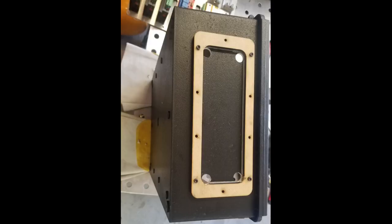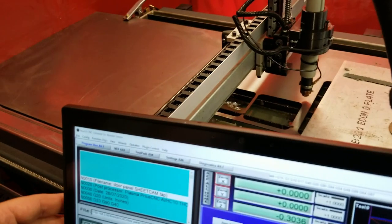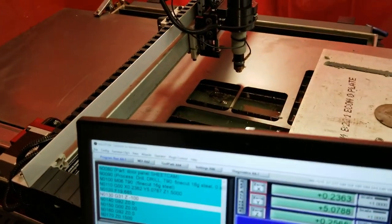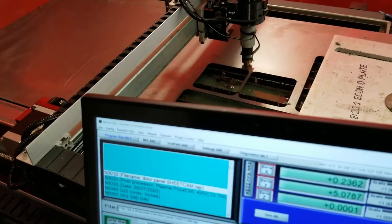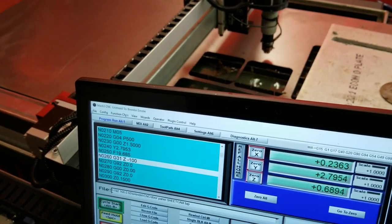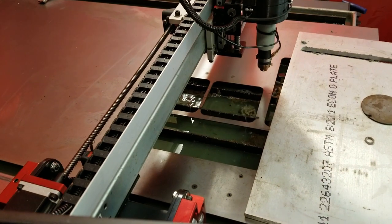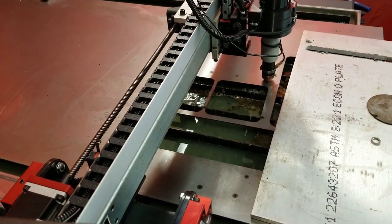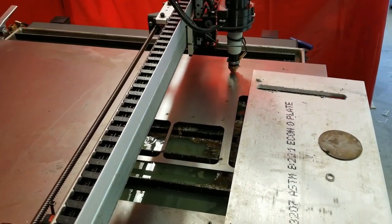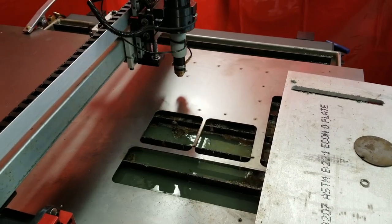Here's a shot of the bottom template — you can see the holes I drilled to cut out the shape for the air vent. I cut it out of 16-gauge mild steel. Here's the front panel. I decided to put the Proma SD in the control box since I'm running the 50-to-1 voltage on it. The Proma SD is temporary — I'll be putting another THC in later. The other addition I added was a safety switch to manually turn the torch on and off relay. The nice thing about using these removable panels is I can make a change, cut a new panel, put new components on, and it's relatively simple.